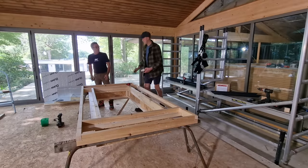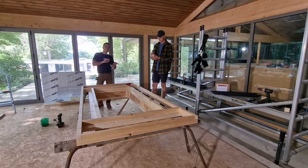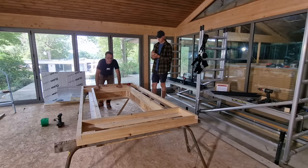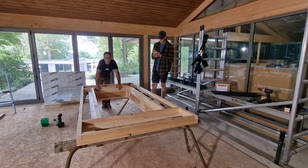We've got an 8mm block as well because we're going to be using Gapotape around our PIR like normal. So we'll put that in and make a list of everything we need. First job: cutting this. Once we've got the cutting list, we're going to use the table saw for this PIR because we can use two dust extractions and get virtually no dust. We've also halved some Gapotape to use it around the insulation.